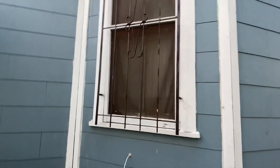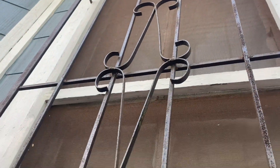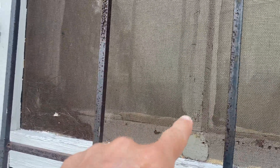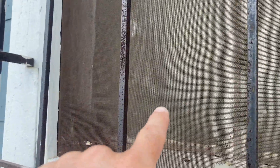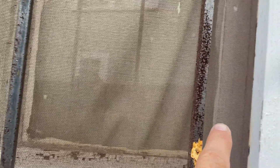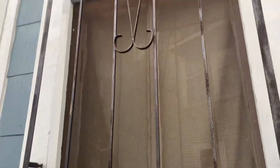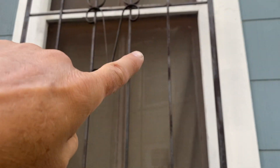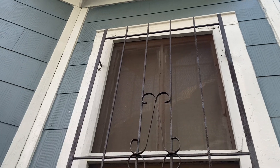That was pretty intact though, right? Here's something good to measure by. You can see that's a two-light window — typical turn of the century around here. That is a 14-inch pane of glass, basically a one-inch muntin in the middle. 14 plus 14, plus 2 plus 2 equals 28, plus 4 plus 1 — that's a 33-inch wide sash. And I think it's a 36-inch piece of glass, which would have been standard, giving it a 40 and a quarter inch bottom sash and a 39 and a quarter inch top sash.